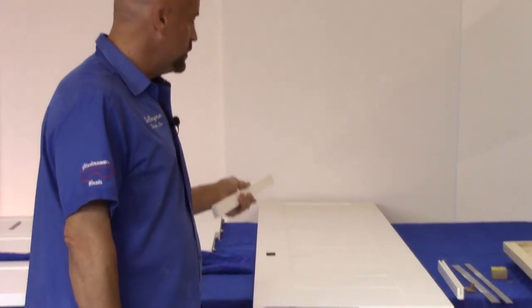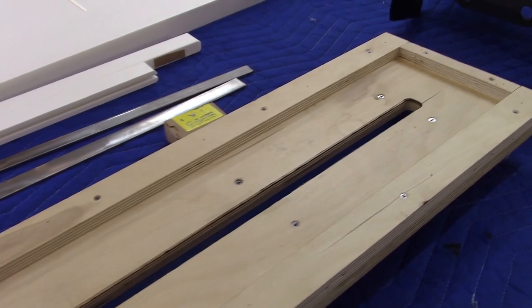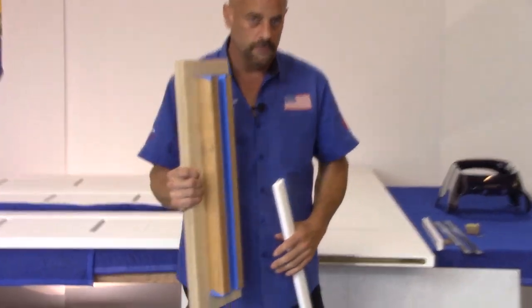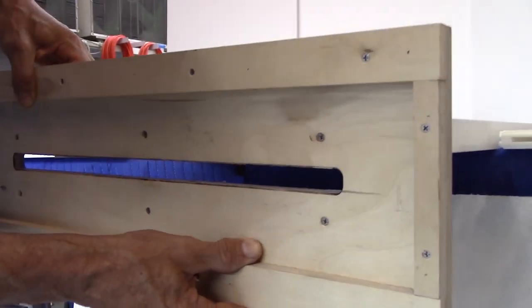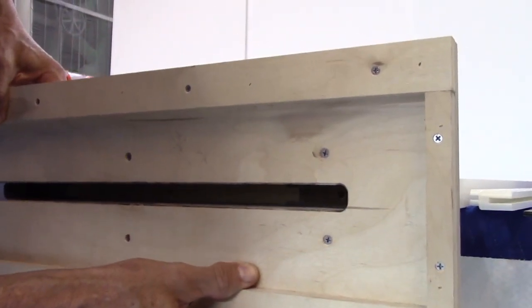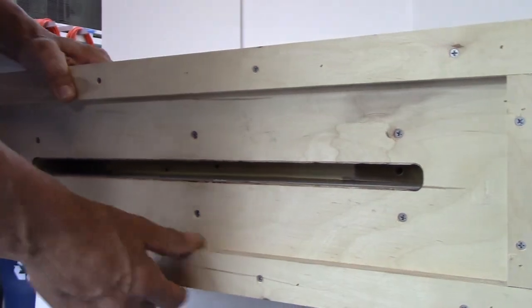So we removed the pocket doors at the home in Hillsboro for our wonderful customer, and we put barn-style sliders in there, which are these doors. So we came up with what's a starboard track. I made up a simple router jig, which goes over the door, and you line it up to where you want, and then the router can stay inside this framework. It will cut the hole out in the door.